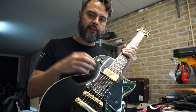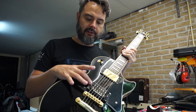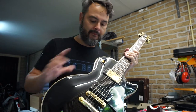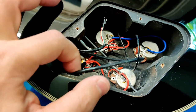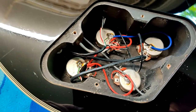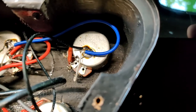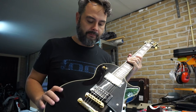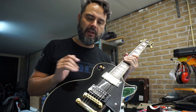One thing you'll notice straight away is the pickups, and that's where we're going to do the modification today. The previous owner has switched out the original Epiphone pickups for a couple of Seymour Duncans — a JB pickup in the bridge and a Jazz humbucker in the neck. Looking into the control cavity you'll notice that these humbuckers have four leads, so that gives the option for coil splitting. The soldering is a bit shoddy so I'll probably replace the pots with push-pull pots and redo the wiring in the future. But as you can see, one of them is missing a cover — basically both pickups came without covers.